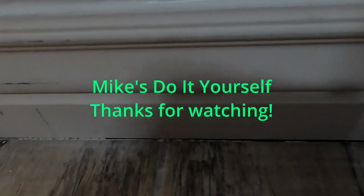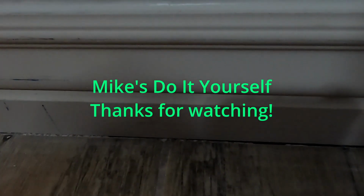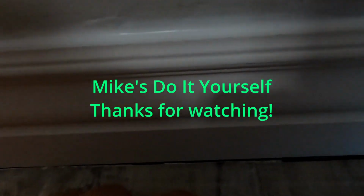Now the gap between the tile and the new baseboard, there may be a big gap or opening there. So you may need to put some tile grout in there. Or they do have colored caulking, so that is an option too. Like if the hole is pretty big, you may want to put a little bit of grout in there if you have some extra grout. Or like I said, they do make a grout caulking that you can squeeze out of a tube. Or if the gap is not that big, like some of these areas here, you can just use that silicone colored caulking and it'll match with the grout, or just pick a color that will match your grout.